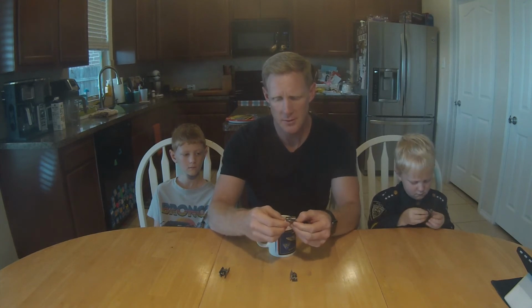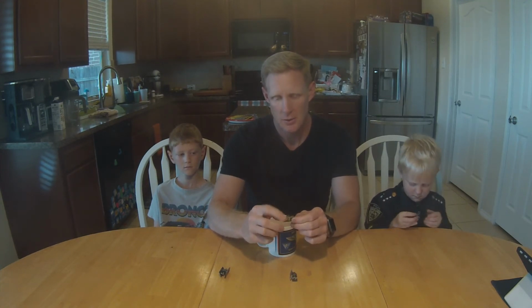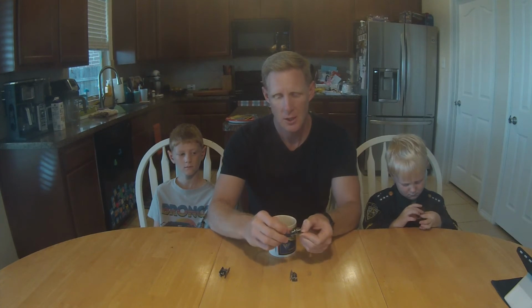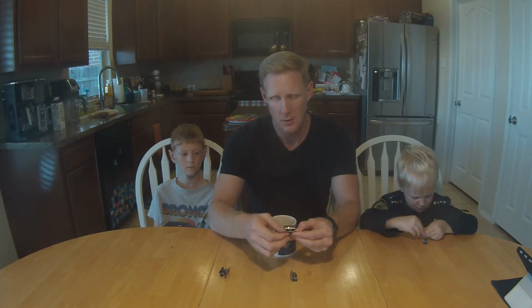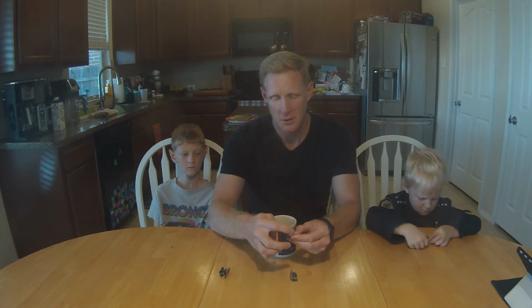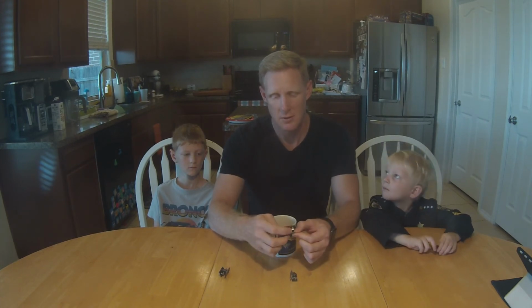So both sides are mounted to the empennage. This here really is just a spacer. It doesn't actually provide any real structural strength. Whereas on this side, on the male end, any kind of fatigue or stress is coming on that weld right there, which gives me a little bit of concern that if something's going to crack, it's going to crack there. And this is just a plate that's held in place. There's no real support there.